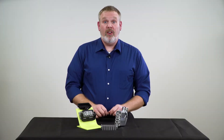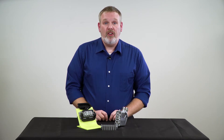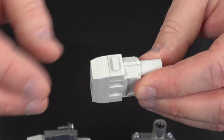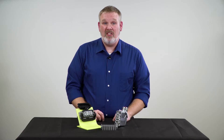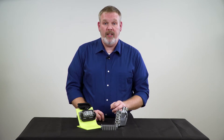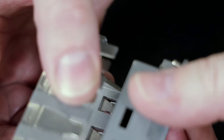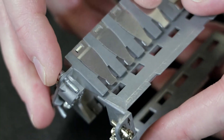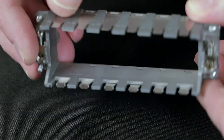So let's explore all of that in a little more detail — this is a Design Details video after all. Looking at the modular inserts themselves, they include a post on each of the short sides. One side is a wide post, while the other is a narrow post. Regardless of the modular frame design used, it must utilize this feature to ensure inserts are oriented correctly so opposite inserts fit together instead of crashing into one another. On these snap-in frames, each insert slot has a wide and a narrow cut to prevent improper insertion.